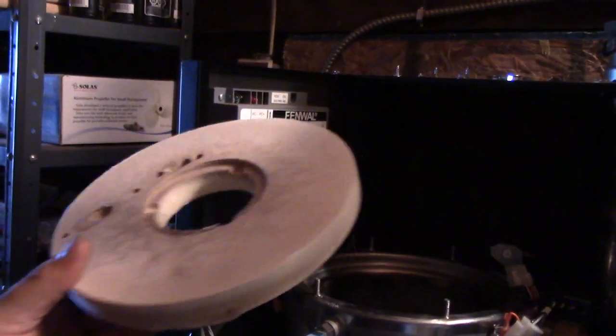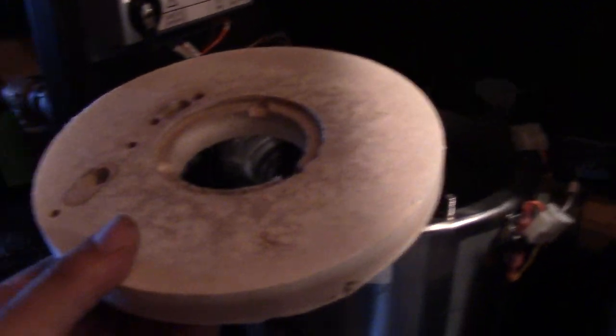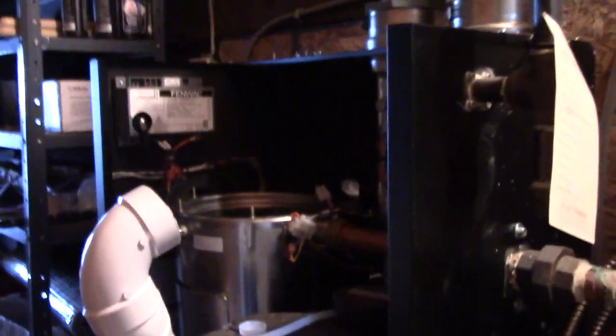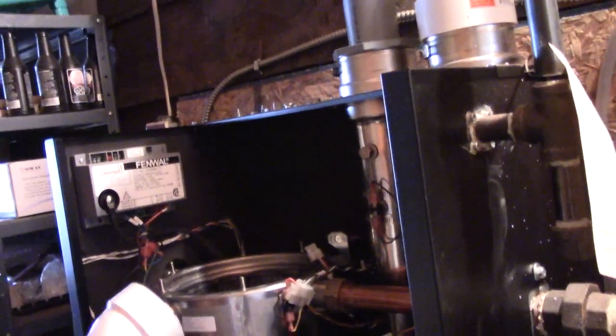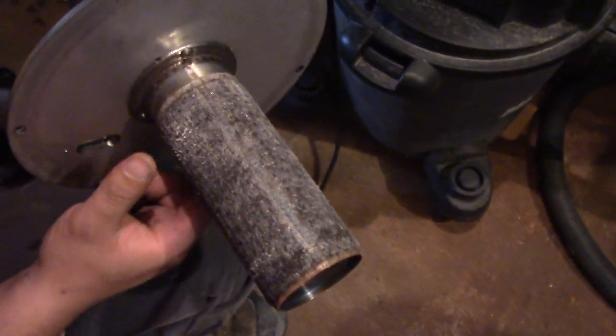Otherwise you'll damage it. If you don't have it in the same orientation it came out — which is basically with this on the left hand side — you can pre-assemble this onto the burner upside down and then drop it in as one piece with the flame rod already installed on the burner plate. As for the burner, it's very simple to clean — you more or less just take a shop vac and suck anything off this stainless steel mesh burner. On the model 115 it doesn't have the stainless steel mesh, it's just a stainless steel tube, unless it's a propane unit. Every other unit from the 160 and up has this mesh on both natural gas and propane.